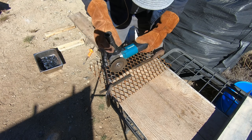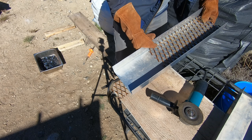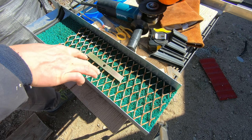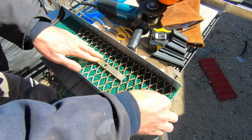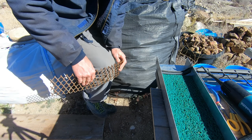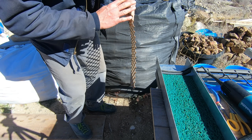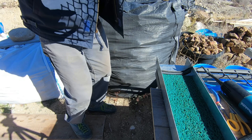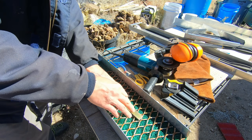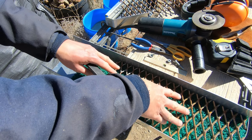I'm trying to rig this up with just scraps I have laying around. I've got this steel bar I can use to distribute the weight and hold the riffles down. I'll give it a bend back here, bend up here — you can see we've got a nice bow. When I push it down it should push all the riffles down evenly. If I clamp it down in the middle, it's going to hold the expanded metal riffles down perfectly. I'm liking this a lot.